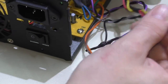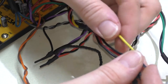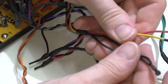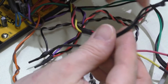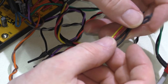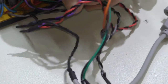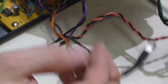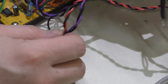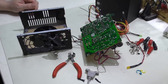These wires over here are the ones I initially brought out maybe as a fan speed controller — 12 volt for high speed and 5 volt for low speed, with a ground for each. I thought about putting an internal power resistor but found it didn't need it, so I left these alone to be hacked for something else. If you look down here you can see the switch, the lights, and the USB connection all come to a head — we're just going to clip this off and separate them.